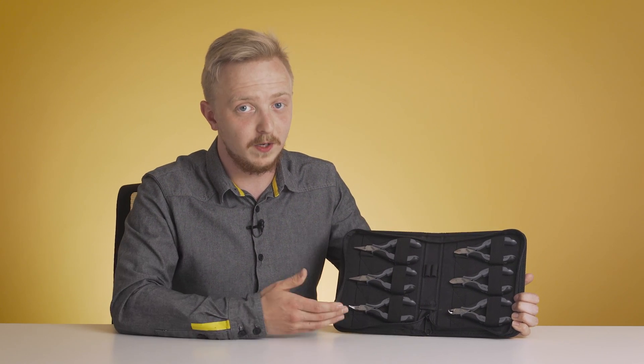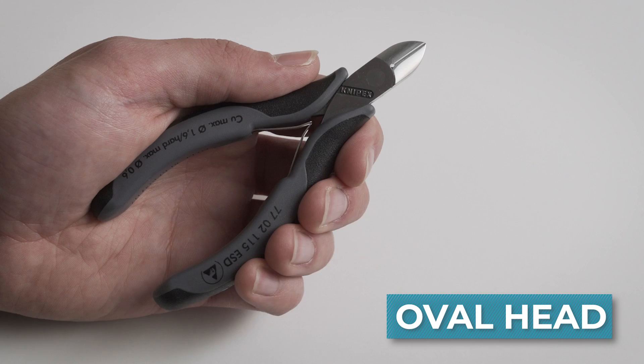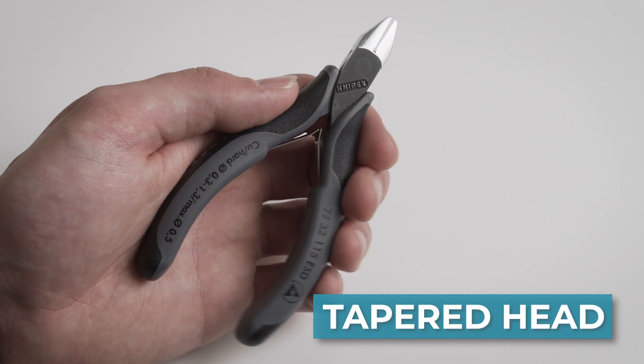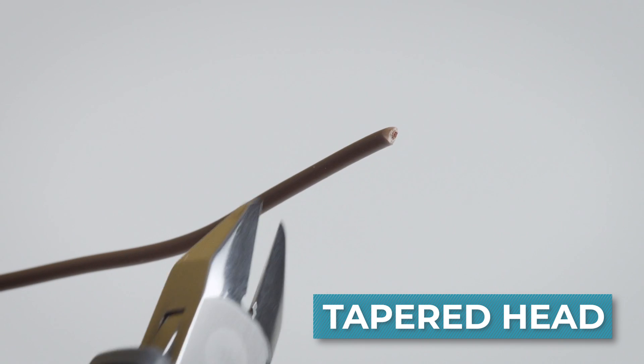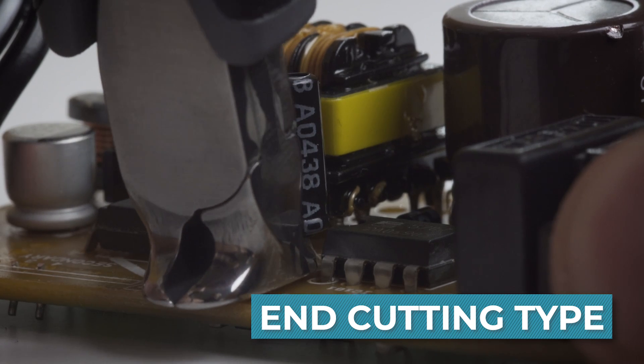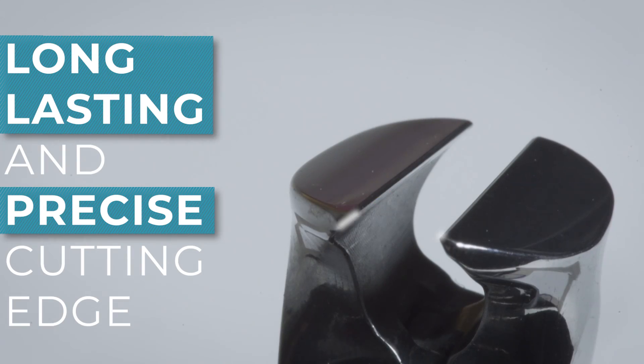On the other side you'll find three cutting pliers, again with different head types: oval head for cutting thicker, harder material; tapered head for more precision when working with thinner material; and end-cutting type for a clean cut in tight spaces. Every pair of cutting pliers has a small bevel allowing for more flexibility — it is a good balance between precision and durability.